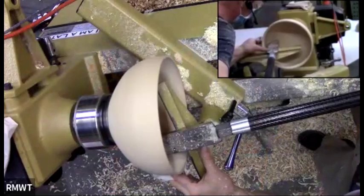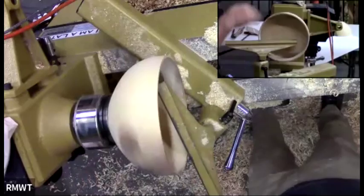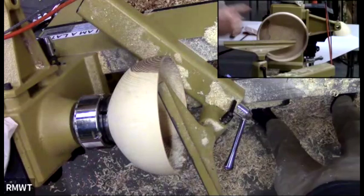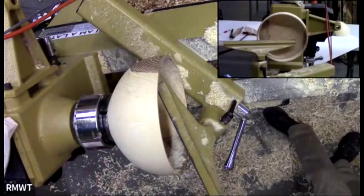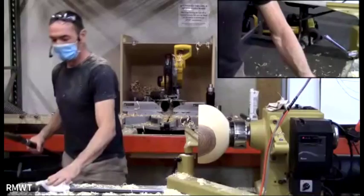So why is this tool so effective at taking out gouge marks? Why is sandpaper not that effective at taking out undulations? There's a little bump, and the sandpaper follows it. So when you're grinding a tool, why is a CBN wheel so effective? What does it do that sandpaper can't do? It doesn't flex. So that's what negative rake is. It's a form of like a CBN wheel, with a great aggressive grit on it, but it can't flex.